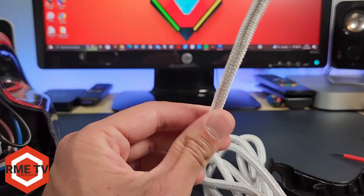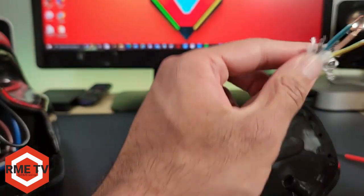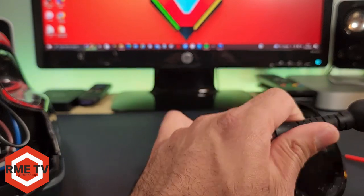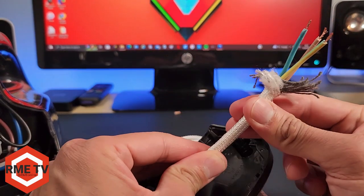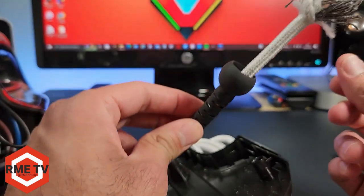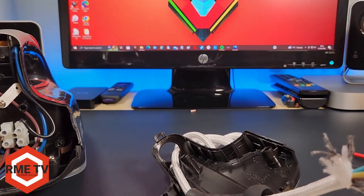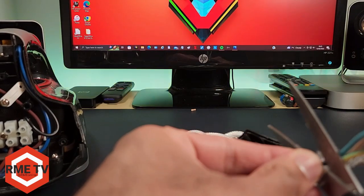Once you're ready, we want to do the reverse process of what we did before. First put the back casing on, then insert the plastic grommet that protects the cable and push that through. Then reapply tape to stop the braiding from coming undone. Once you've put the grommet on, you want to cut away the excess braiding material — make sure you get the order right because you can mess it up. Use scissors to cut away the excess material, being careful not to cut the wires.